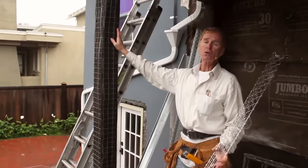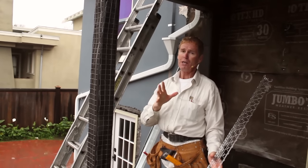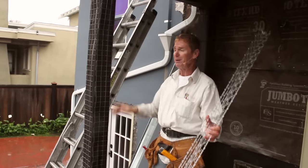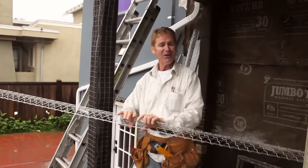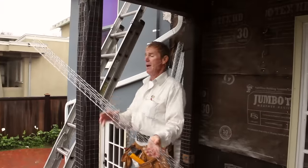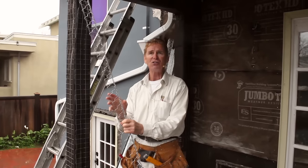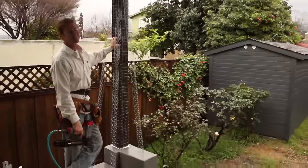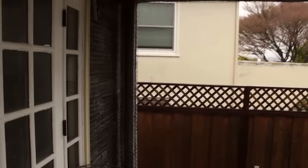Here's the thing — you see all this right here? This is a whole box of corner aid. What is corner aid? It guides us so we don't have to try to make corners freehand. We have well over 600-800 videos showing how to do almost everything related to interior plastering and stucco. I've shown how to make corners without corner bead, but that's too much work. This is a seven-foot pillar and these corner beads are ten footers, so we're going to cut three feet off each one. Once we do that I'll show you how we attach them. We made it through the rain, thunder, and lightning.